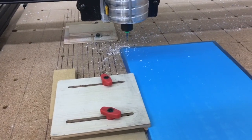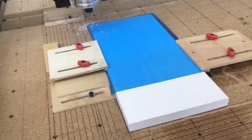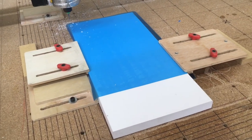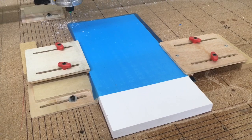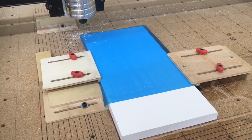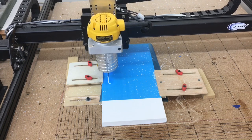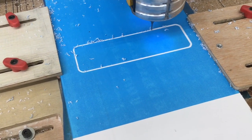I have the 1/16th of an inch down cut bit in the router. I have my PVC board in place and secured. Because I'm not cutting all the way through — just cutting the surface — I'm using bump stops to hold it in position. I'm going to do a total depth of about 0.1 of an inch, and for this first carve I'm only going to go down 0.03, so it's still a very shallow cut. As this started carving, it's actually carving very, very nicely with that 0.03 depth.